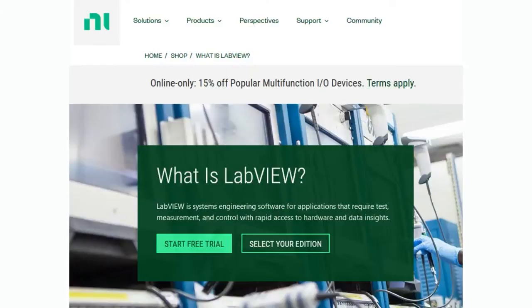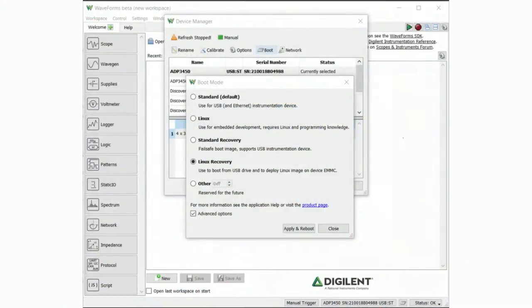You want something that's like an oscilloscope but something you can script and use within LabVIEW. I think that's the sweet spot for this product. Yes, it can be used as a general purpose tool, but it's kind of big — it's not pocketable like the Analog Discovery. This is a benchtop tool. This would be good for benchtop data analysis, data capture, test and analysis of a product. I've seen people who have a product going to market and want to do a lot of testing — this would be able to do current capture, waveform output, and testing the digital and analog side all at once. It's scriptable, and with LabVIEW it's going to have first class support.